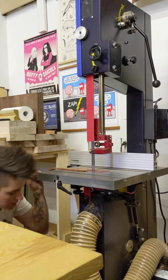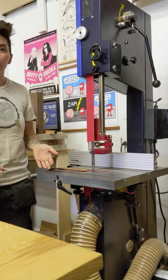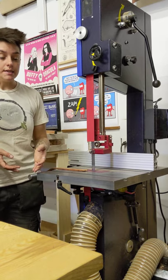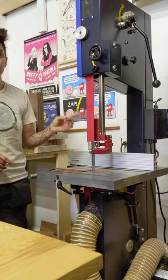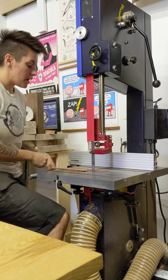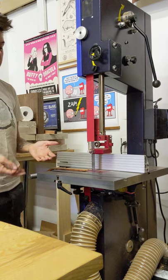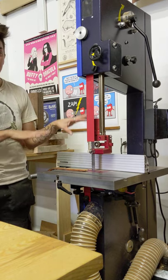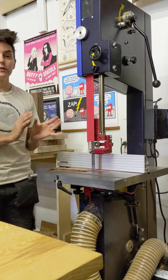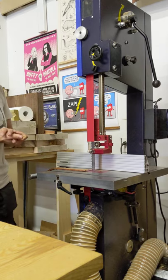The last feature I'm super into is the brake pedal. When it came out of the box I wondered how useful it would actually be, but I've found it's fantastic. You don't have to turn the saw off and on between each blade adjustment — you literally stop the blade with the brake, safely measure and adjust as much as you want, then release it and it turns right back on. It's also great for when your blade binds or you just want to pause quickly. That's a phenomenal and really underrated feature.